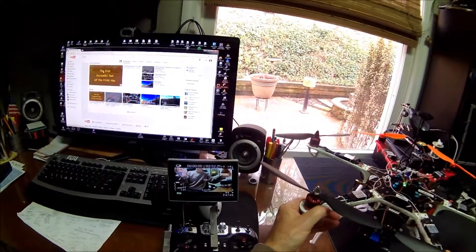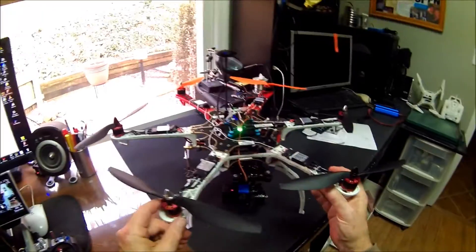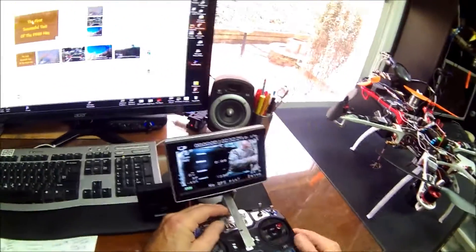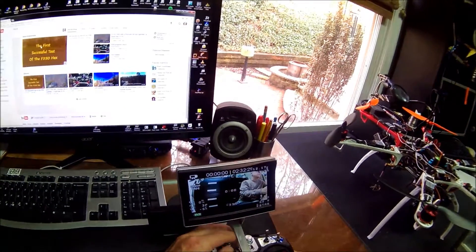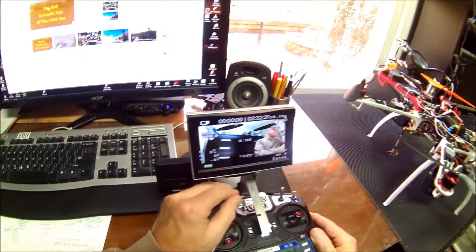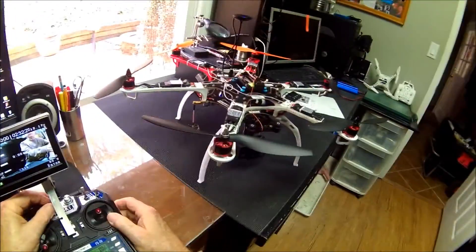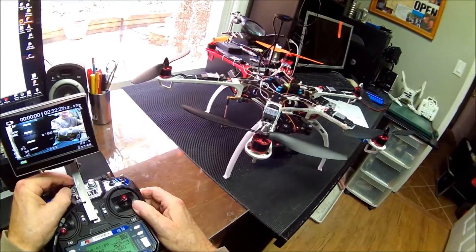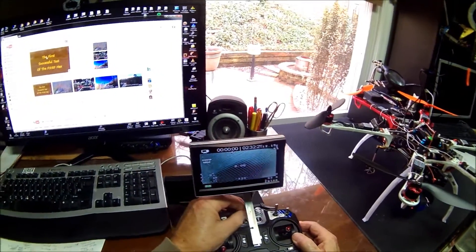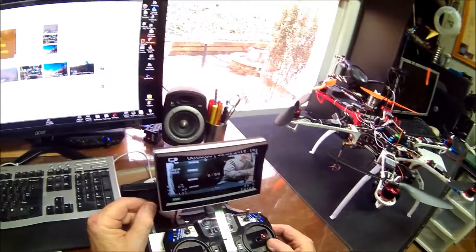There's the compass heading of the craft — if I turn it around, north should be right about there. The gimbal just booted up. Variable resistor A controls the gimbal tilt. It's heavily buffered but I haven't figured out how to make the camera move faster yet — accelerations are at max. Turning the knob goes straight down; for horizontal I use a piece of zip tie hot-glued onto the knob.